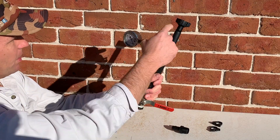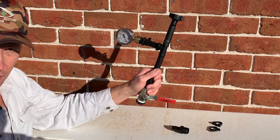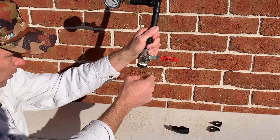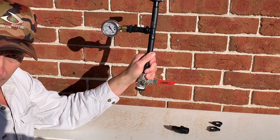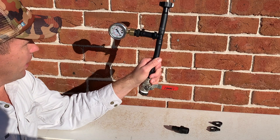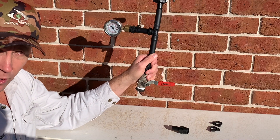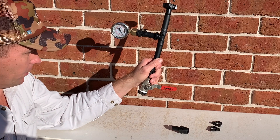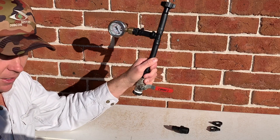Basically we can check two things here. We can have this valve shut and we can check static water pressure — the pressure of the water that's not moving. And then we can do the flow test at the same time. We can connect this into the 9 litre bucket and time how long it takes to fill it. That will give us all our calculations to correctly work out how many sprinklers we can run on one line and how much they're good for in water delivery. I'm going to build this up and finish it off and then we'll go around and test it out.